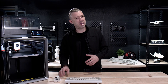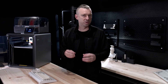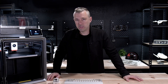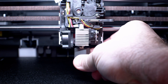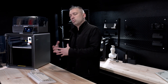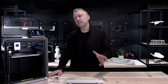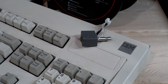When it comes to swapping the nozzle, it's kind of a mixed bag, as the nozzle isn't standalone in the S1 — the official Anycubic nozzle is, for the most part, glued into the hotend. That said, removing and replacing the hotend and nozzle are about as easy as it comes, as the S1 features a simple drop-down and pull-up lever to release the entire hotend, attached by a cable at the rear that just needs to be unclipped. There are several third-party manufacturers offering nozzle and hotend options for the S1, and I see the benefit of baking nozzles into the hotend as it mitigates many issues newer consumers might encounter.